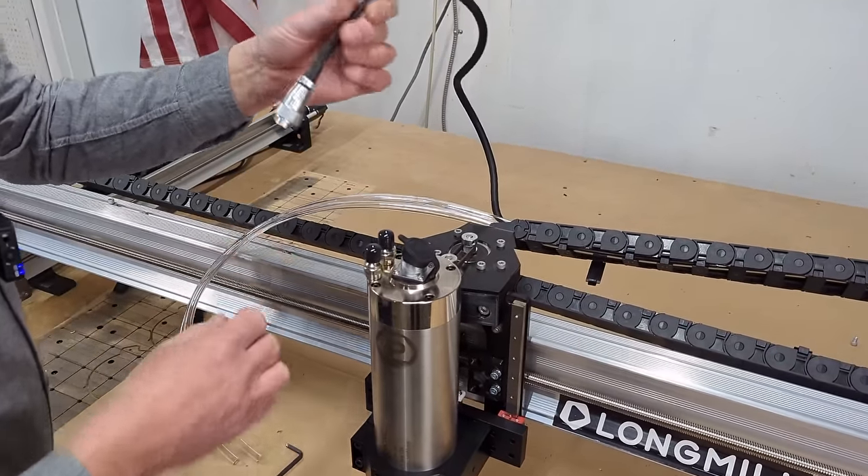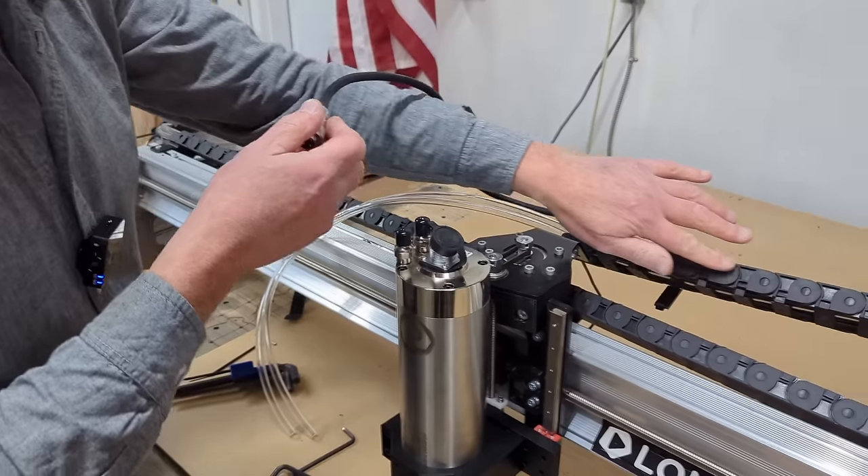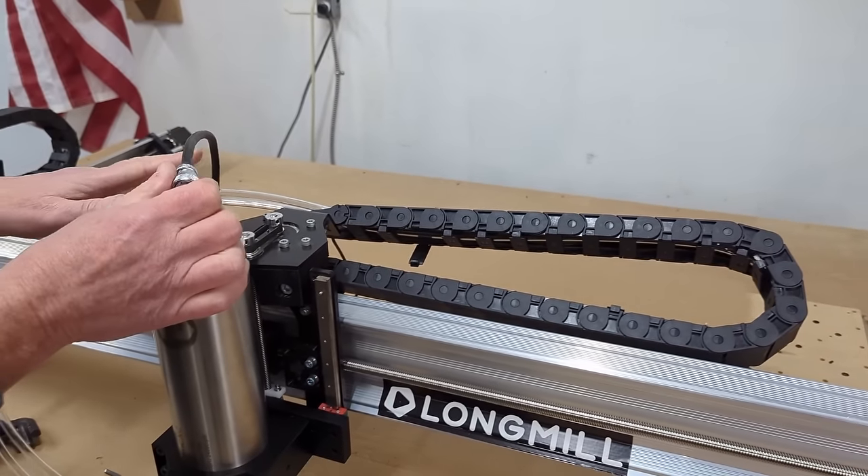I'm going to put the spindle in — this little step here will sit at the bottom of the bracket. Hold it with your hand, orient the PWN symbol forward. There's quite a bit of weight, so be careful not to get your fingers underneath while doing this — several pounds could drop and break a finger. When clamping around a diameter with a full circle clamp on a round object, that's the strongest way to clamp. We don't need a lot of force — there's already a ton of grip.